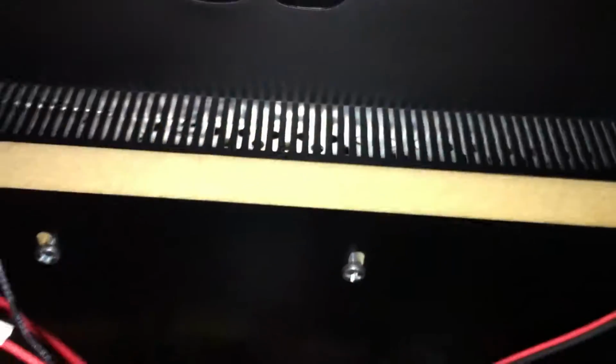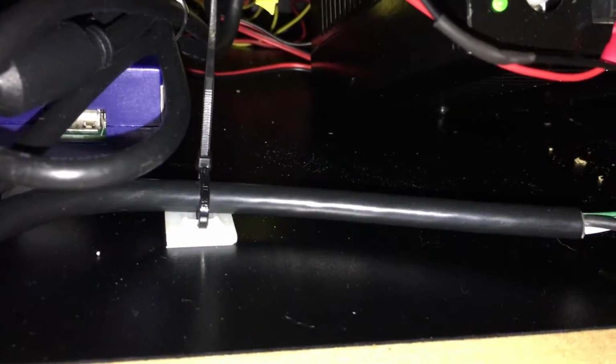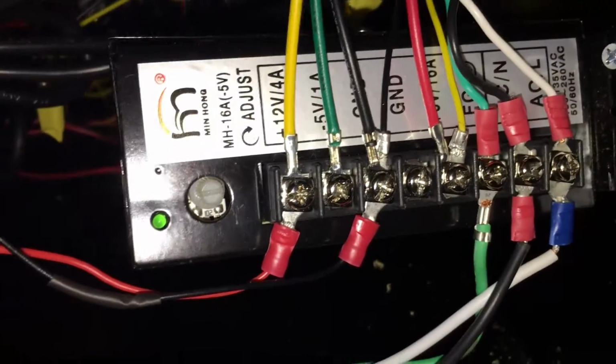Now, I did a little bit of engineering, not much. You can find instructions on how to do this online, but most LCD monitors run on the same voltage as this box, or can take the same voltages. So I actually wired right off of the power in for the monitor, and it works. It doesn't overheat, doesn't give any weird voltages out. Everything I checked with a voltmeter gets all of the proper voltages, and it works.